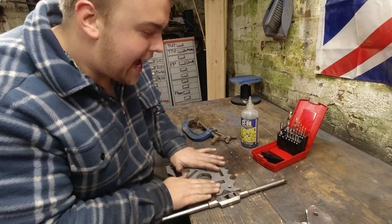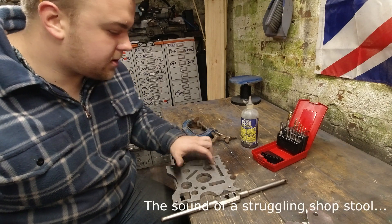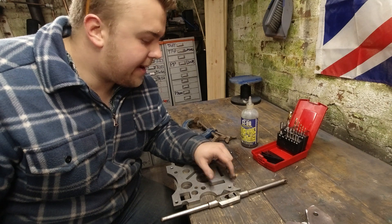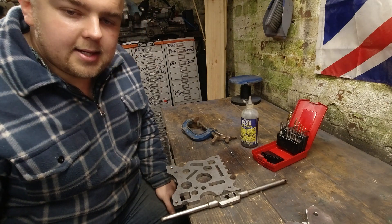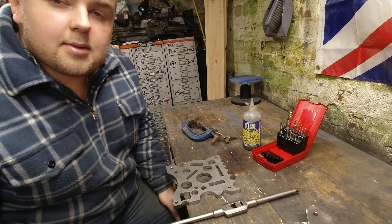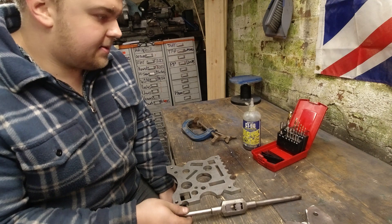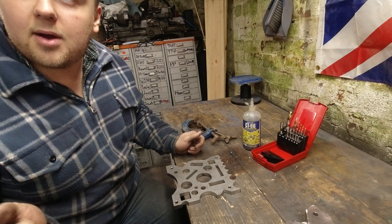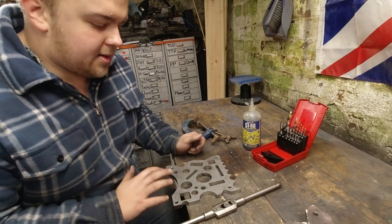Okay, so we have drilled out the nut plate as I'm calling it and we've put a little bit of a countersink onto here. The laser cut holes were a little bit undersized so we've just drilled them out to 8.5 and given them a little bit of tap relief — countersunk and broken that edge. It's not quite small enough to fit in my vise so I'm going to clamp this to the bench and use a tap wrench with some tapping fluid to go in nice and easy. I still haven't got a tapping guide block. I could do it in the pillar drill but the M10 tap is a little big and I can't get this within the throat of the pillar drill, and my milling machine is set up for another job so I'm going to do this by hand.